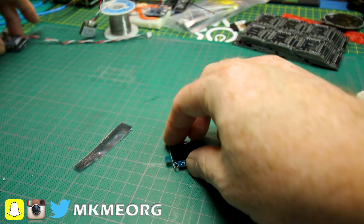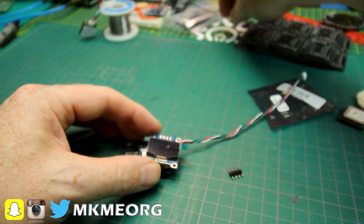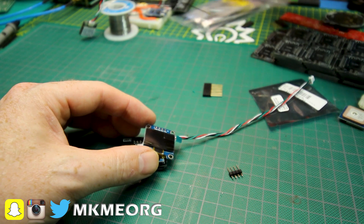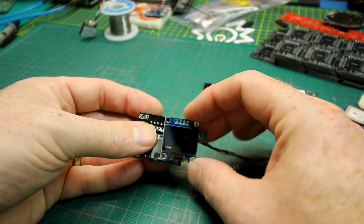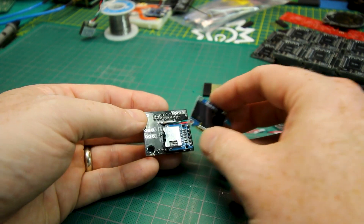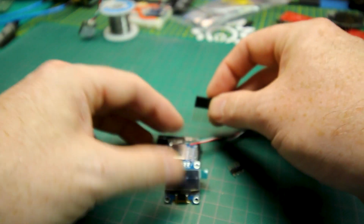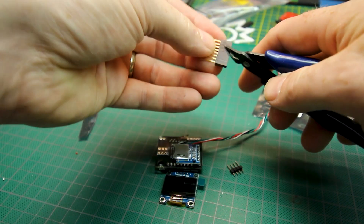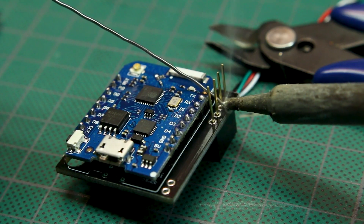Since this is a prototype, I'd have to decide where to put the LCD — whether we're going to use some stackable headers or ribbon cable. In this case, I decided to stack it right on top. The way I designed it, the pins are in order to do so on the top or bottom — you just flip it around. I decided to make everything as compact as possible and use these extended long stackable headers to just plug it right in. Solder these up and we should be good to go.